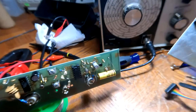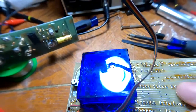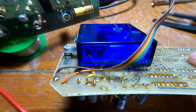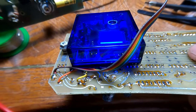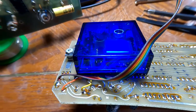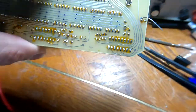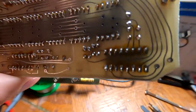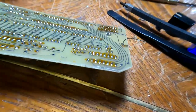Doing a little poking around, it looks like there's a problem with this cable here. The next step is to trace continuity using a 14-pin DIP socket connector that goes to the board and then to the switch on the front, but it's only using seven of the leads. It seemed to work only when in certain positions when I moved the wire around — probably a bad wire or cold solder joint. I also found an untrimmed capacitor lead floating on the board that I'll take care of while I'm in here.